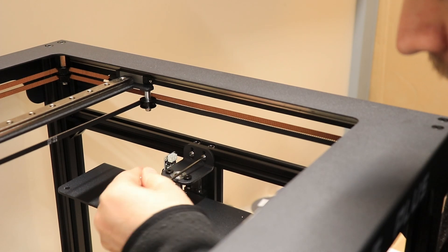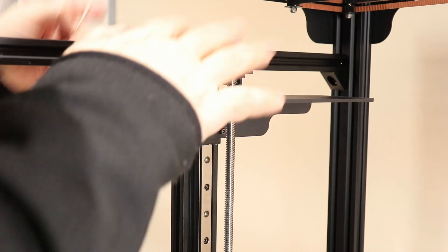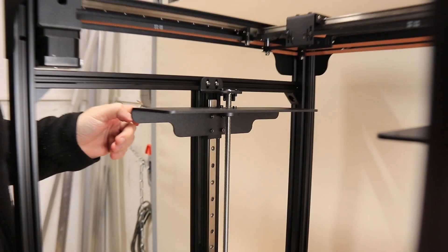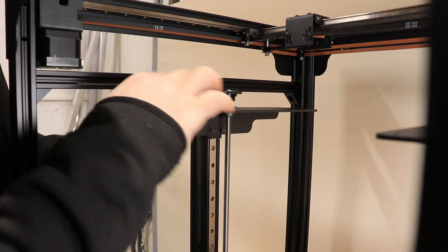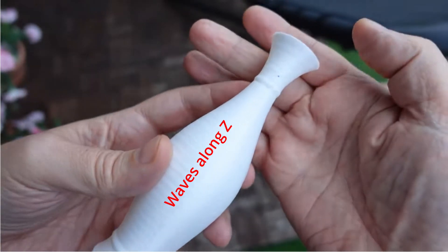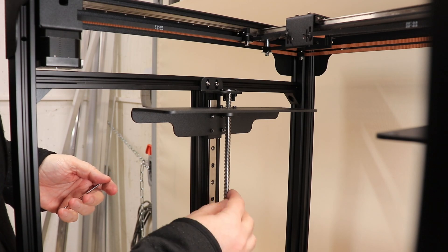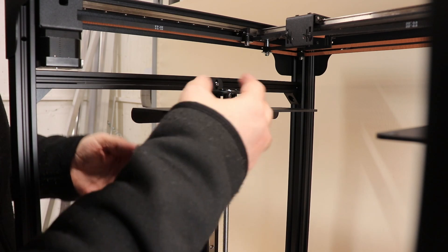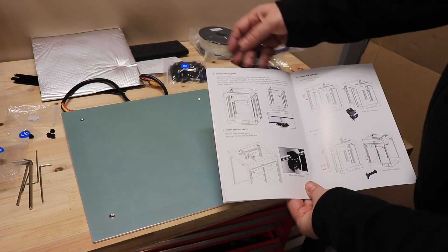The other side is tight too. I'm not a big fan of these holders — on one side we need it because it holds the limit switch, but the holders mainly just protect the lead screw from bending, while actual movement is secured by the linear rails. Step 9 is installing the heating plate, but they don't mention at all that it would be good to place the thermal insulation now while it's much more comfortable. I try to place it in the middle so the hole stays open, and then install the knobs with some tension on the springs, compressing them approximately to half size.